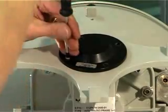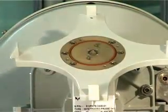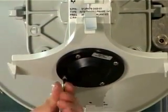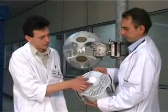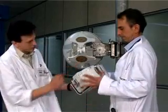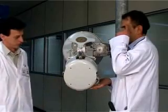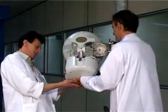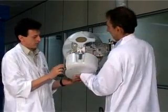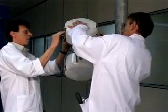Remove the protection from the flanges on the ODU side of the kit. Warning: this must be done just before hooking the ODU. Check the polarization of the ODU and also that the gaskets are in place, then hook it on using the catches. Repeat the process for the other ODU.